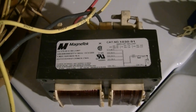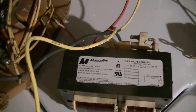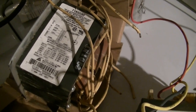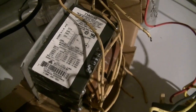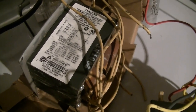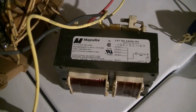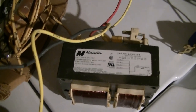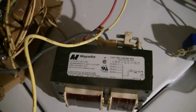A couple weeks ago, I posted a video on diagnosing a faulty capacitor for a high-pressure mercury/metal halide constant power autotransformer ballast. This is another ballast in the same lot that I got from an eBay seller at the end of 2020. There was a poster on that video who was absolutely adamant that the operating current of a 175-watt H39 high-pressure mercury lamp is 2.4 amperes, not 1.5 amperes.